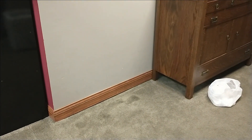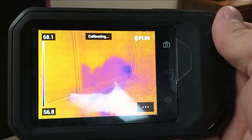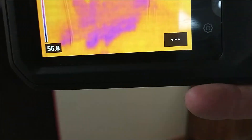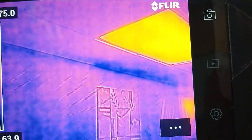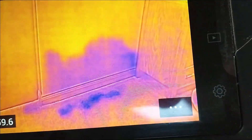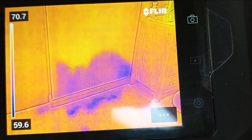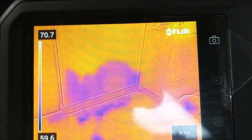That's how well the FLIR C5 shows moisture — and I don't have temperatures displayed, but you can tell by the way it looks. The cold air up here appears wispy, whereas down in the wet area we have firm lines that the moisture follows along. As the drywall gets wet and moist, it begins to cool off as it evaporates, and that is how we can tell, even without a moisture meter, that it's wet.